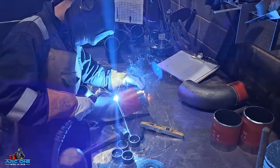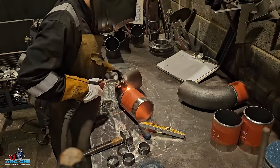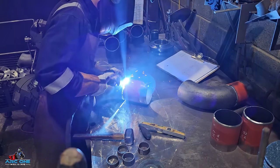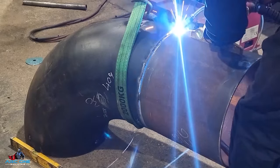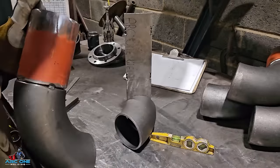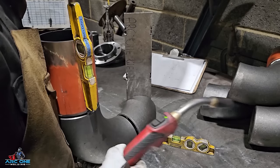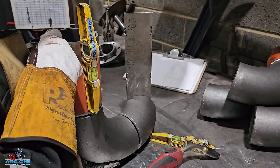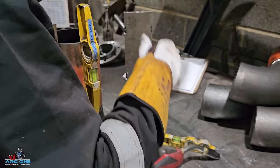Four drawings: two of them are 20 mil sets, two of them are 30 mil sets. I'm sure you could just cut the pipe, but the drawing didn't say to cut the pipe — it says cut the fitting, which is why I'm doing this whole process. It works for any size pipe. The bigger the pipe the more accurate you have to be and you should use a laser level, because on big stuff your gap can be touching one side and 25 mil on the other — you can't weld that.